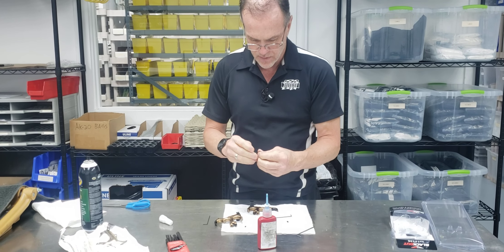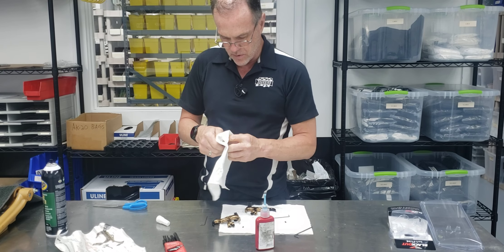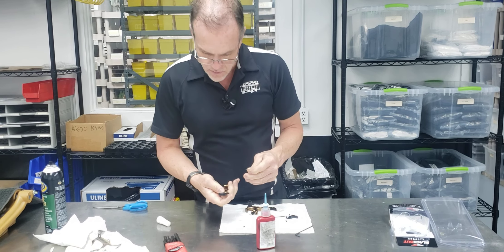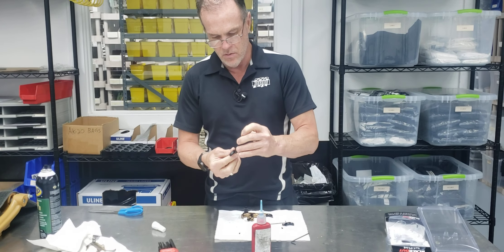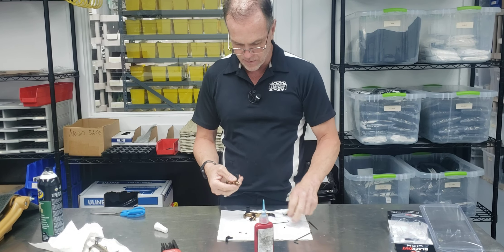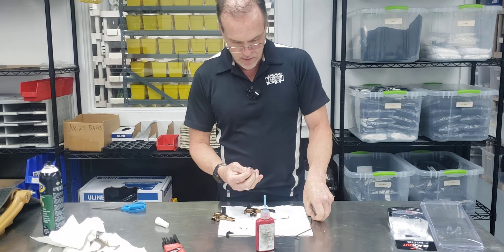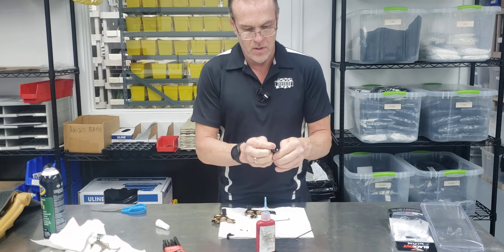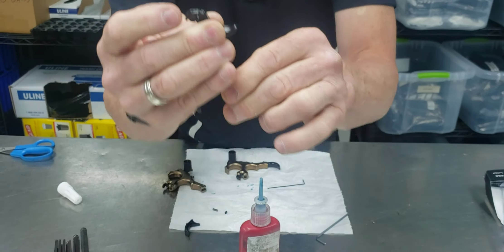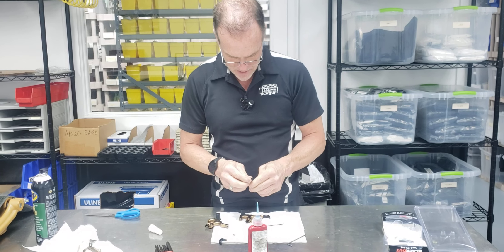To change from three to four fingers: in the bag there's some glue — they glue it in the package — so you'll need contact cleaner or alcohol to get the glue off. The third finger comes out using a 1/16th allen key; loosen that screw and there's a pin that falls out one side — turn it upside down and it'll fall out. For the fourth finger, they don't thread the screw in for you, so you'll run the screw in until you can just see it coming through, then back it up. You'll need to reuse the screw you took out of the third finger.